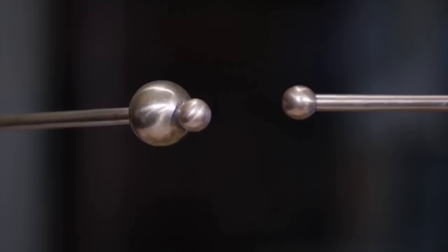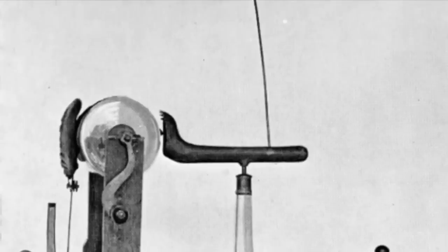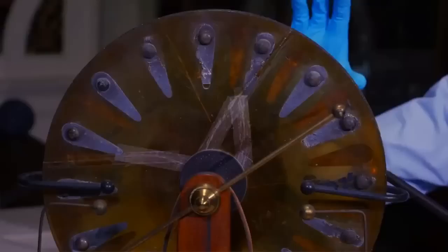These were a big improvement on earlier machines which used triboelectricity — they were more reliable and able to reach higher voltages. Because of that they're extremely popular and were used in early X-ray machines. The whole thing works on a process called induction, because just like magnets, opposites attract and the same repel. So a negative will repel another negative, leaving a positive charge — that is an induced charge, and the process is called induction.